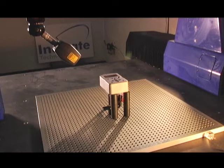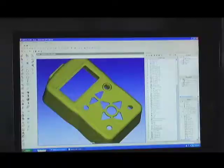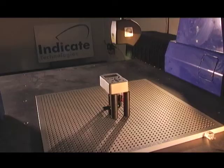Because we have this laser sensor mounted on a PH-10M, which is an articulating Renishaw probe head, it gives us the ability to reorient the sensor in the volume of the machine and acquire data from different orientations. Brian has actually worked up a macro here, so let's have him run through that and give us a narration about what's happening.